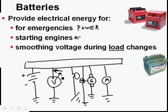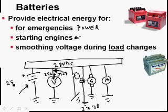So let's just say the voltage regulator is set somewhere between 27 and 28 volts. So we're sitting here cruising around 27 volts. This voltage, if we watched it very carefully, it would only come down to about 25.2, because in a 28 volt DC system, the battery that we're going to have in here, brand new fully charged at 80 degrees Fahrenheit, is going to be 25.2 volts. So the volts are only going to drop a couple of volts.